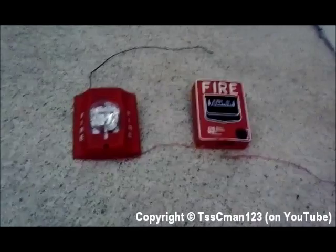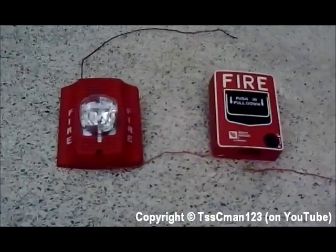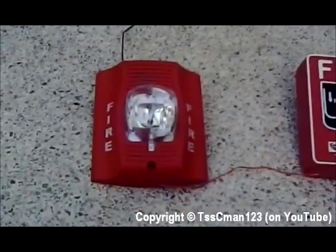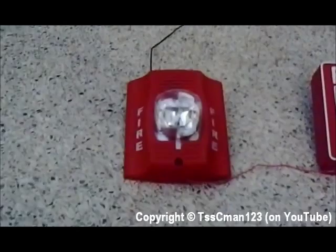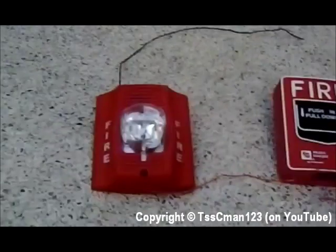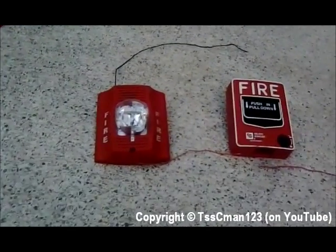This can be done, but it does involve batteries. Most notification appliances run off 12 or 24 volts, meaning you can use one or two 12-volt batteries. They are sealed lead acid, like the kind found in cars. If you use two batteries they have to be connected together, and it will save energy because it uses less current at 24 volts versus 12.